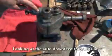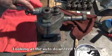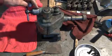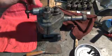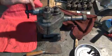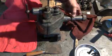This has a fast and a slow feed rate that you can select, like 27 thousandths per revolution or 9 thousandths per revolution, 18 thousandths per revolution or 6 thousandths per revolution, 39 thousandths or 13 thousandths per revolution. And each one of these has a fast or a slow associated with it. That's the two separate numbers. And the fast and the slow is set over here with this guy.